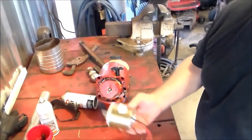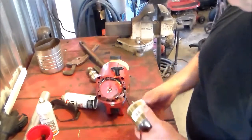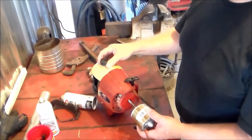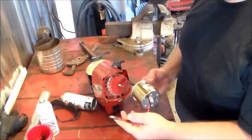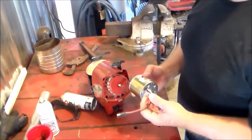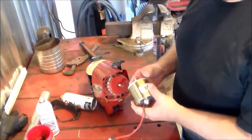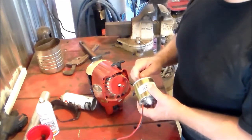Being a glutton for punishment, I told him I'd take it and mess with it for a while. Some of you see this little electric motor — you've probably got a good idea what I'm gonna do. I'm gonna make a coupler and couple this engine to this electric motor and make a little generator. I've got to put a diode in-line to prevent the battery voltage from back-feeding into the motor and trying to run it. This is a little brush motor and when you turn it, it will generate its own electricity at enough RPM.